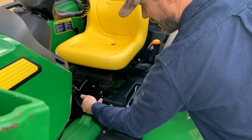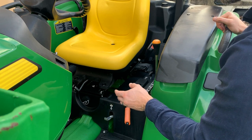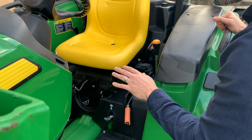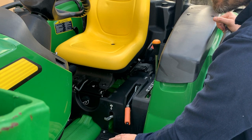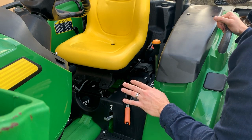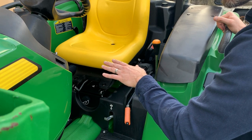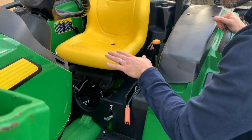And you can turn it either way and it's going to open or close a relief valve that is essentially going to control the amount of fluid that's coming through it, which in turn affects how fast or slow your 3-point control drops down. So if you want to maintain really good control over your 3-point lowering down, say you have a box scraper that you want to just trim down real slow, you can almost entirely close that valve there and make that happen.